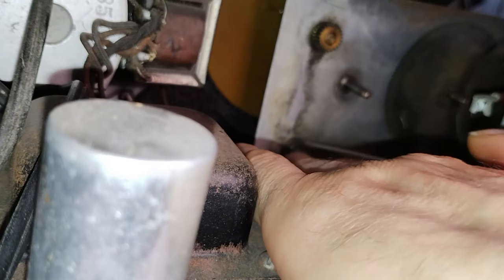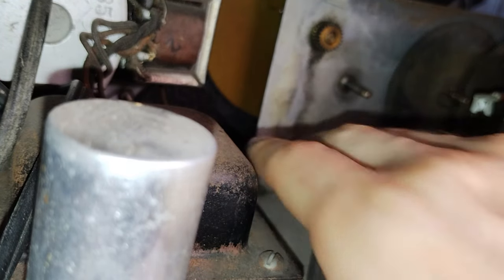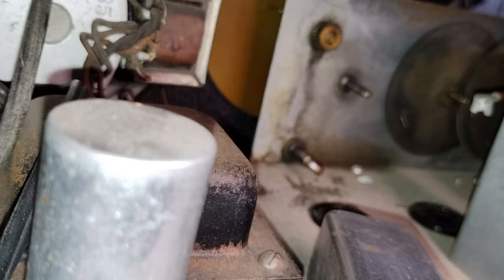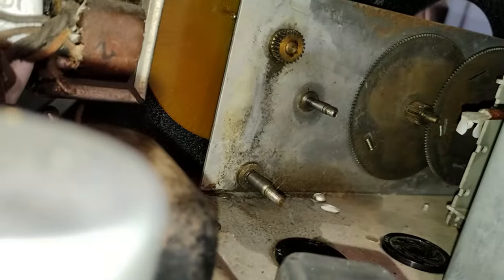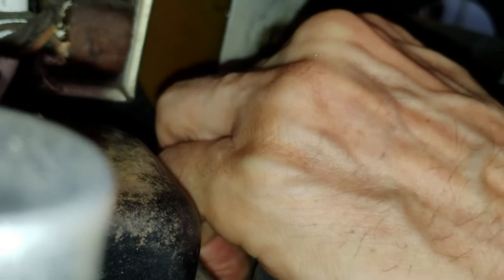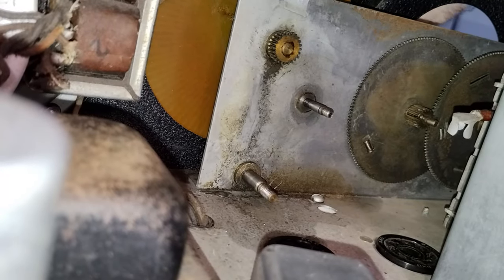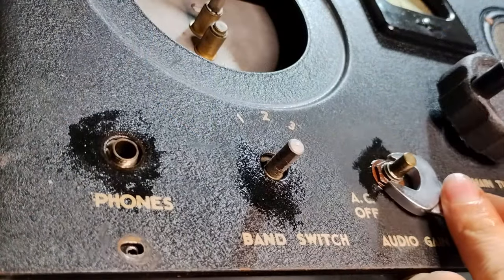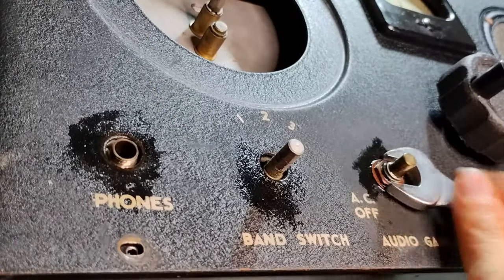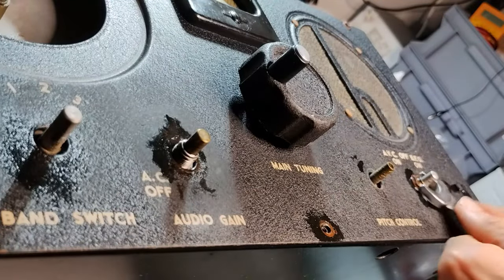The new plan about the tuning knob is to extract it together with the shaft, but there is another obstacle before that goal, a C-clip. Without the proper tools, removing the C-clip became a battle in which the old clip had to be destroyed. But the shaft still doesn't want to get out. Waiting for better inspiration, there are still other components waiting to be loosened from the cabinet, and then, finally, also the upper lid is removed.